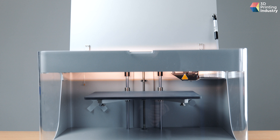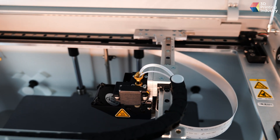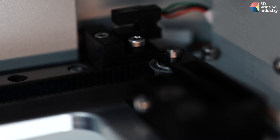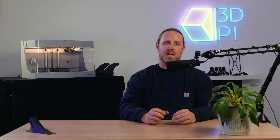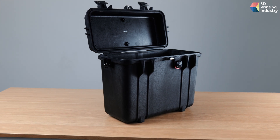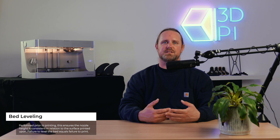Our first hint of something special comes when lifting the lid to reveal the T-Belt Axis system. Compared to a standard Cartesian setup, the system is more rigid, faster, and more accurate. Specifically, the belt configuration is purpose-built to minimize torque on the gantry while still allowing for rapid print head motion. The linear rails are precision machined to maximize accuracy. The build chamber is fully enclosed and the print bed is unheated — yes, that is correct, the bed is unheated — and yet during the two months we spent 3D printing with the Mark II, not once did we use glue or any other adhesive to ensure first layer perfection during our 678 hours of testing. Other features include a 4-inch full-color touchscreen with a clean and refined UI, and an external spool holder that serves to create a humidity-free environment, ensuring safe long-term storage for optimal filament performance. Bed leveling is via the basic 3-point method, and whilst manual, the user is guided through the 10-minute process with on-screen instructions.